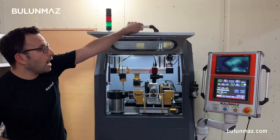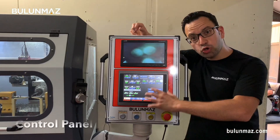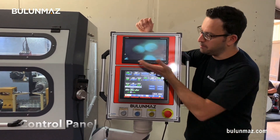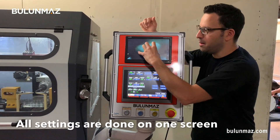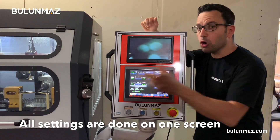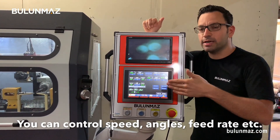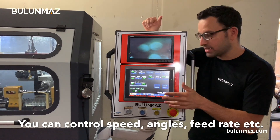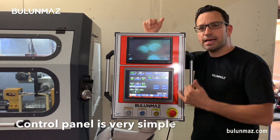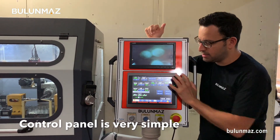I'm now going to the control panel. Here is my control screen — it's just one screen and all the settings are done here. You can see the control screen below my camera, which shows your diamond cut ball very focused. On this screen you have all the settings such as which degree you will hold the heads, which degree to limit, how many times they will work, the speed, and the degree settings for both horizontal and vertical diamond cut heads. You can set all the speeds, all the movements, everything you can do with the machine.